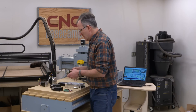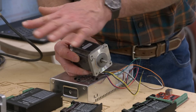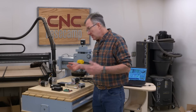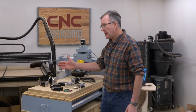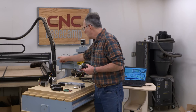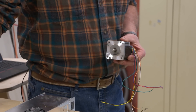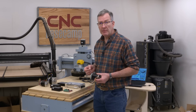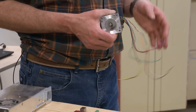Moving on to the individual motor — the motors are different sizes and they're sold in ounces for the torque they'll put out. I have three motors here that I bought as a package from Build Your CNC, meant for a homemade machine with a fairly heavy gantry. This large motor powers my gantry back and forth along the x-axis. The two smaller motors power the z-axis and the y-axis. The smaller motors have eight wires; the larger one has four, but they're essentially the same. We're using what's called a bipolar setup, and the Build Your CNC site has a lot of great wiring information.